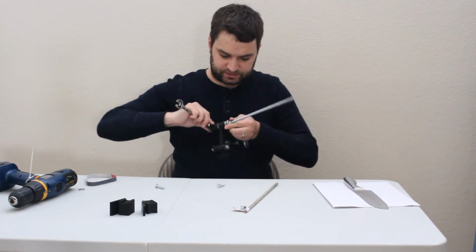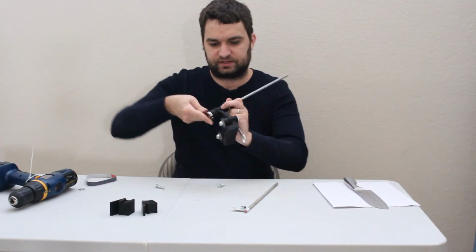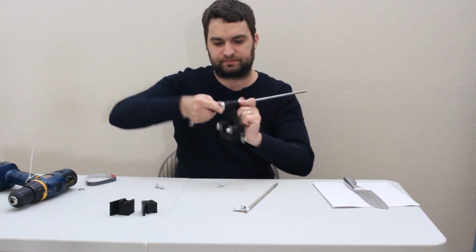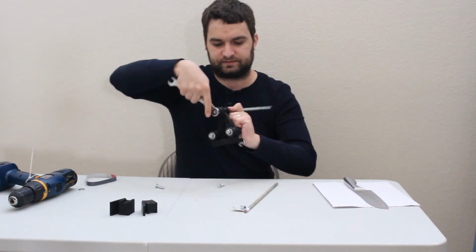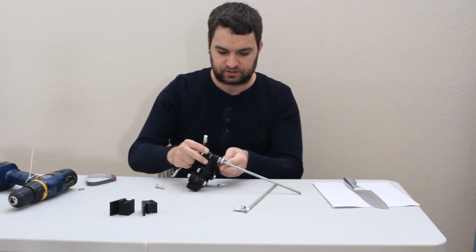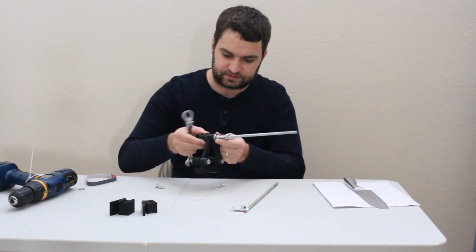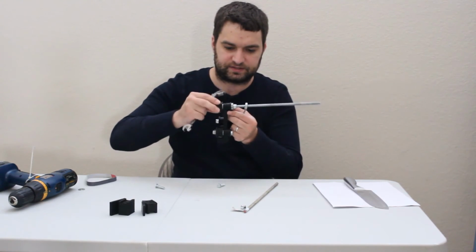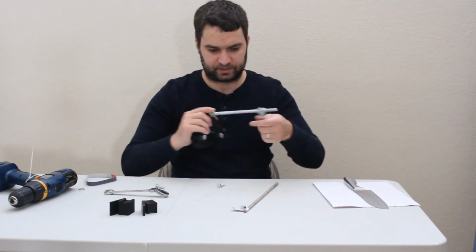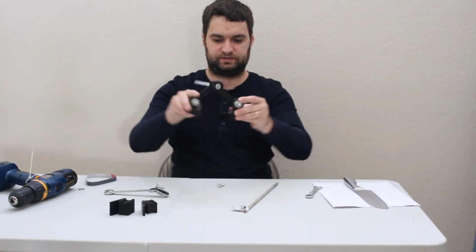And I'm going to use the ratcheting one to try to get this adjusted again, just like the other 2 pulleys, so that it's snug and it doesn't have a lot of slop, but so that it also doesn't bind. You can feel it starting to bind when it does, but so that the belt gets held straight, you really don't want to under tighten this either. It's got to be just right, and that's about just right. So now you see we have this thing, and we can do sort of like this.